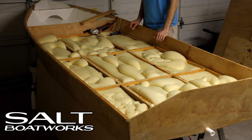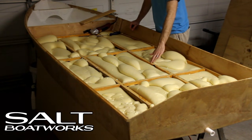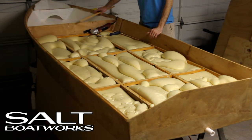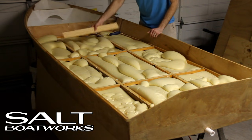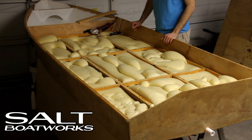The first step is to take off all the high spots. Our goal is to have the floor sit down flush across the top of our beams and also flush with the foam. I like to use a scrap piece of wood as a guide to show me where I'm too high, so I know where to cut. You can use a hand saw or blade of any type, or a power tool — just trim it off flush.